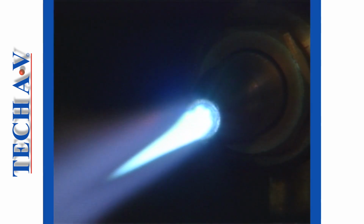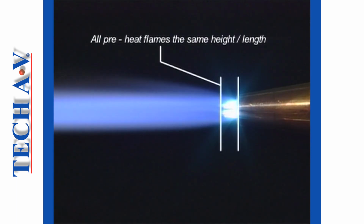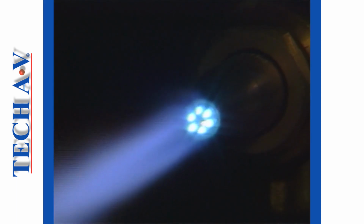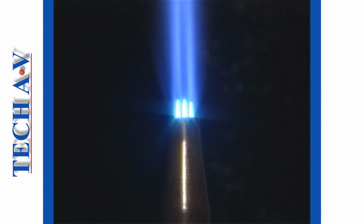A neutral flame is one that has a clearly defined bullet-shaped inner cone and the absence of a feather. Check that all the preheat orifices produce a flame of the same height. This indicates that the orifices are not blocked and that each is delivering the correct volume of gas. Now depress the cutting oxygen lever. The preheat flames should remain virtually unchanged.